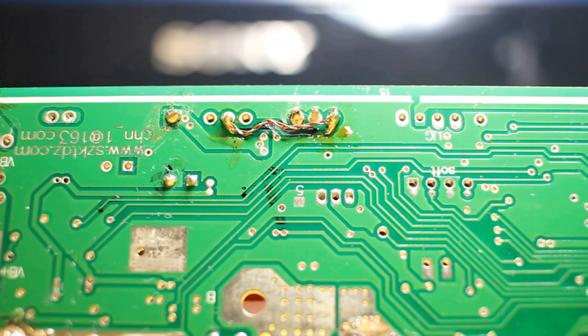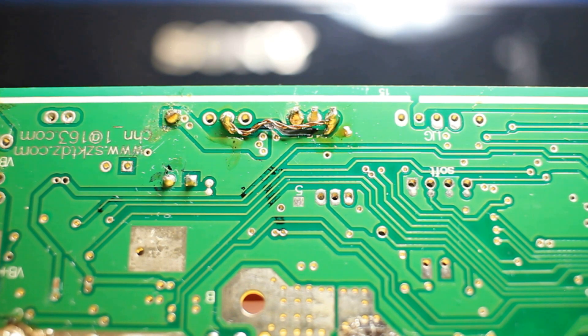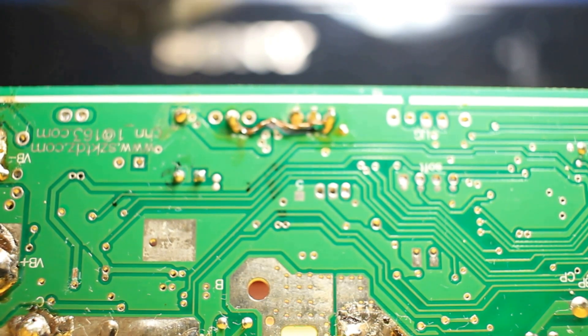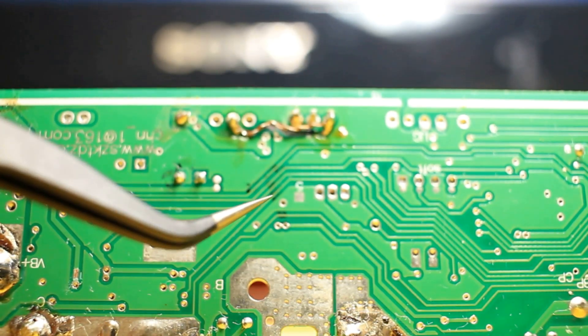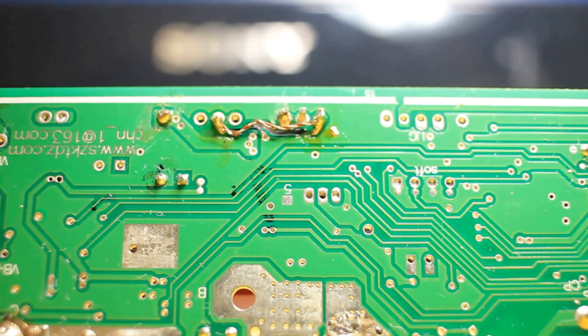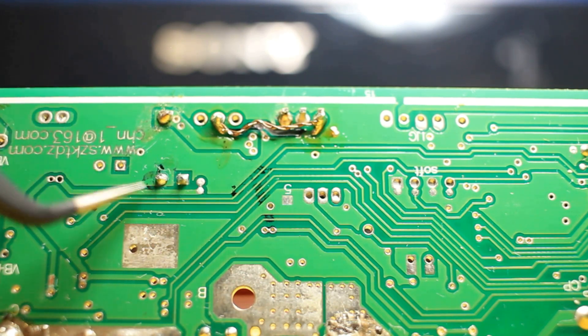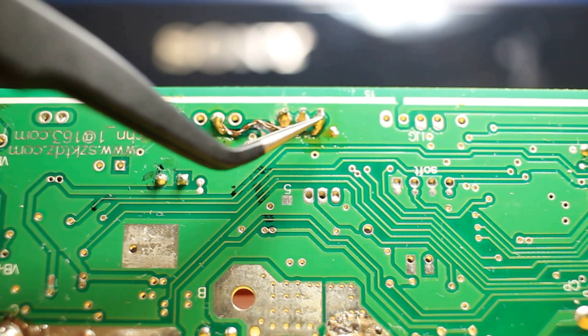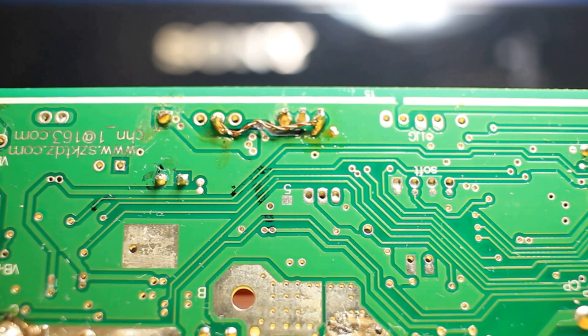That's pretty much all I wanted to show you guys today — a quick short video on how to repair your traces. Whenever you get a break or burn out something electronic and you don't really see any burnt parts or broken capacitors on top, turn it over, take a magnifying glass, and follow the traces to make sure they are complete. If you see a broken one, clean it up and solder in a piece of bare wire from point A to point B as an artificial trace — that's all you need to do. I hope this video has been educational and helps somebody out there wondering how to repair a trace. I'll see you guys next time!